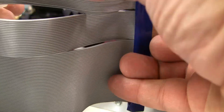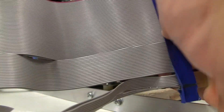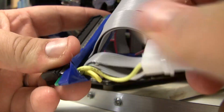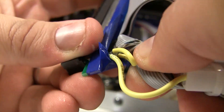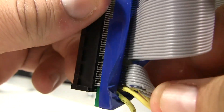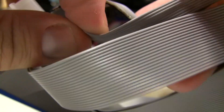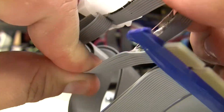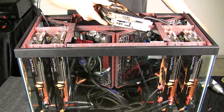We did, however, have a cable burnout — as you can see in the video — when we used a powered riser in the 16x slot. That experience is a primary reason I'm very against powered risers on the BTC board; that cable nearly caught fire. Of course, experiences vary, so we have a Facebook page — get on there, post your pictures if you've had issues with different configurations, and share them to make the community stronger.